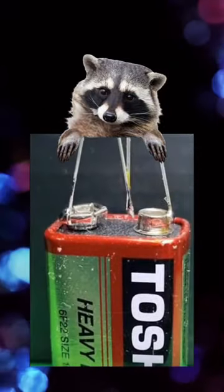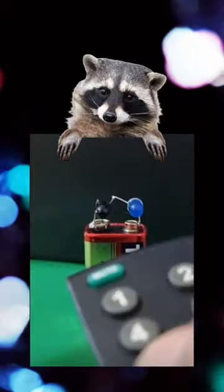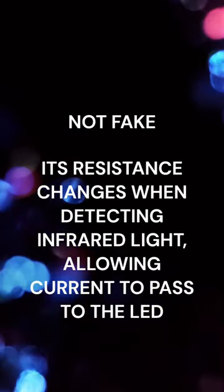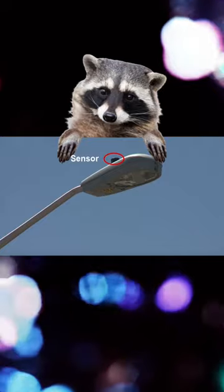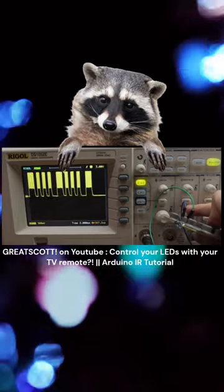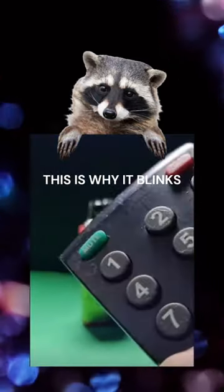in which he wired an LED and infrared receiver in series to a battery to create an infrared detector. Is it fake? No. The infrared receiver is just a detector — just like the ones used to detect sunlight on street lights, only it's calibrated for infrared light. When you press a button on a remote control, it emits pulses of infrared light, which gets detected by the receiver, letting energy pass into the LED.